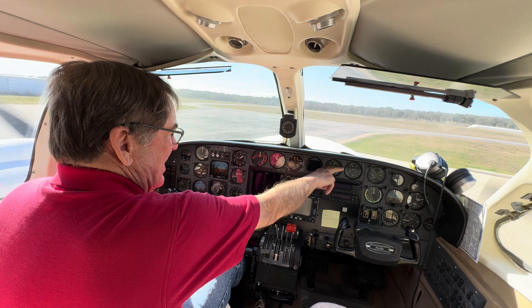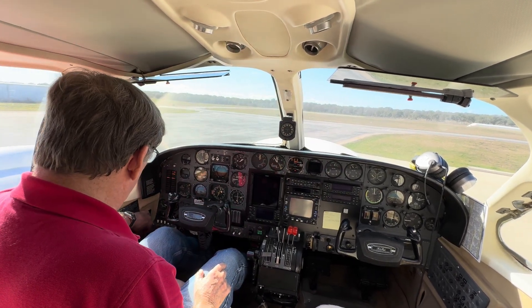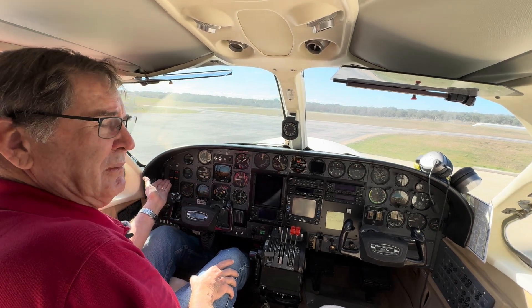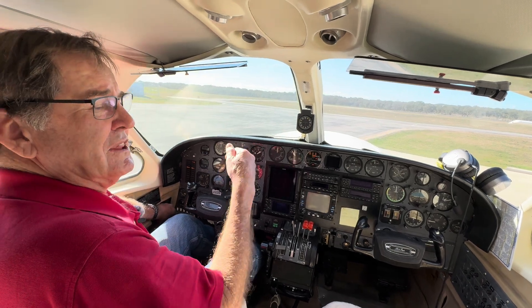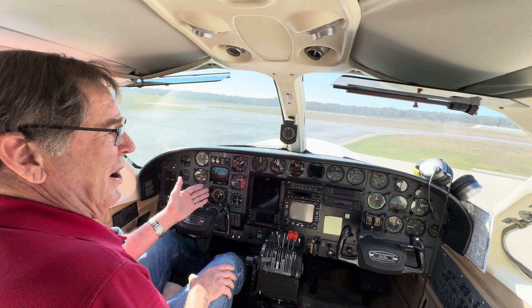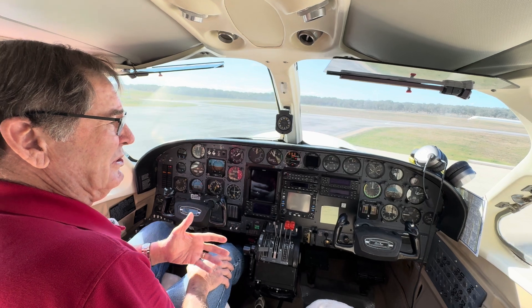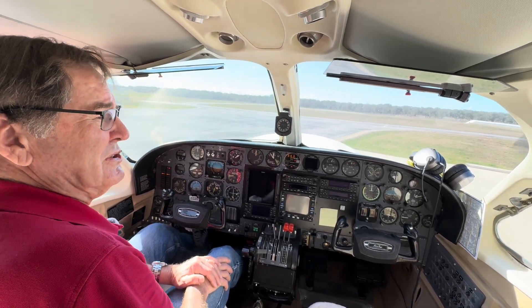By the way, we're going to check the oil immediately. Both of these came up, and we're going to get both alternators on. We're going to verify the warning lights are out, then go down and look at the volts. We should be 27.3, 27.6, or you may be 27.1. Remember, the 421s have a little bit lower voltage output than the straight shafts. So that's the way we start our 421.